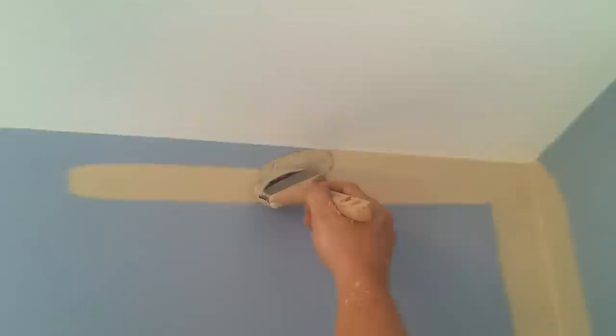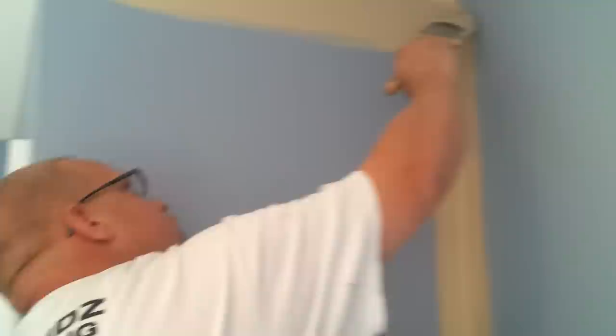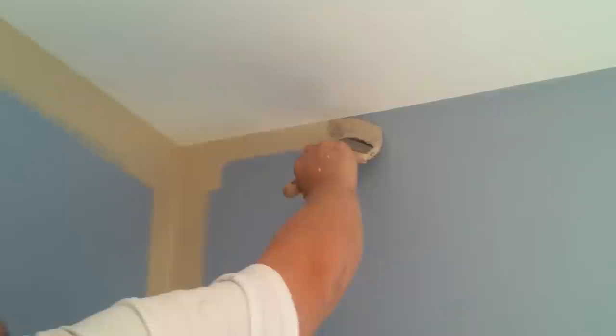Fan your brush out and move it along. In this case, the homeowner had done some painting and they kind of went a bit high with the blue, so we're obviously trying to cover that up. Find the best place to make a straight line so you don't see it. Feather everything out. Again, start in the corner, and if your room is too hot it will make your work difficult, so keep the room not too hot.